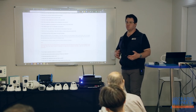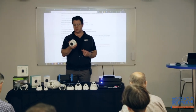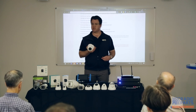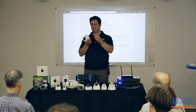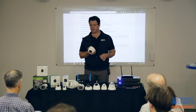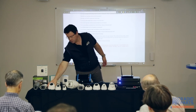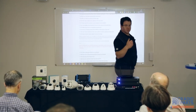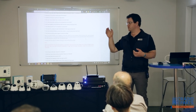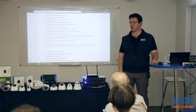For people upgrading old systems, the typical approach is to take one of our newer AHD cameras and put it into analog mode, so it still works on the old analog system using the existing coax. There's a little joystick control on the camera: press it to the left for three seconds and it turns to composite/analog mode; press it to the right for three seconds and it turns into full AHD digital mode. So this can upgrade an old system just with a new camera. Once all the old cameras are replaced with AHD ones, switch them all into AHD mode and you've got 1080p, 2-megapixel quality all the way through.